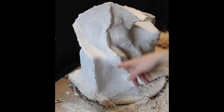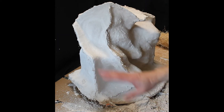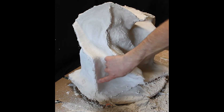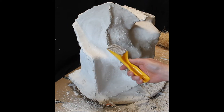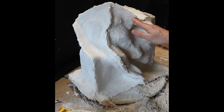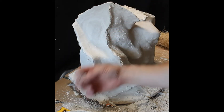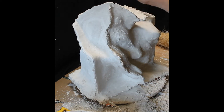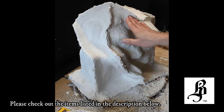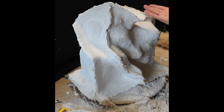I have this done now. Don't worry about the rough appearance — it's not going to interfere with function. After this cures 24 hours or longer, I'll take a saw or a sure-form rasp and work down this edge. I'll probably hit the fiberglass, which will fray at the top. If that bothers you, I suggest a cutting wheel on an angle grinder or a Dremel — an angle grinder can make short work of it, but do it outside because it's going to look like you kicked a bag of flour in your studio.